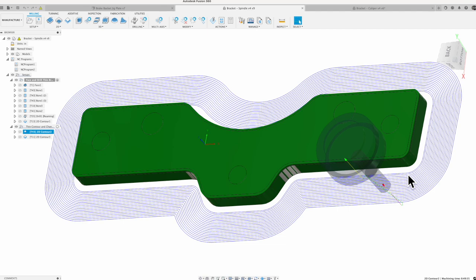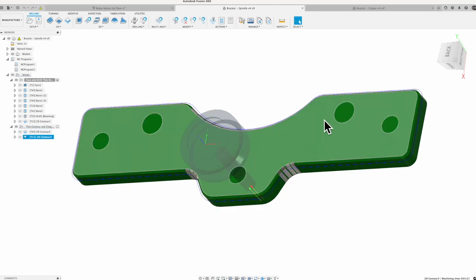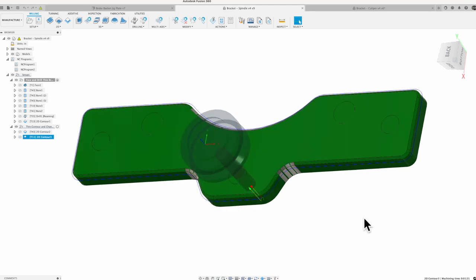I see this all the time on some YouTube videos. Everybody seems to swear by using the side milling, and we're just going to do step overs to cut those contours on there. We'll see how that does. And then after that, we've got this 1/8 chamfer to put around the whole part. So that's pretty much it for the backside.